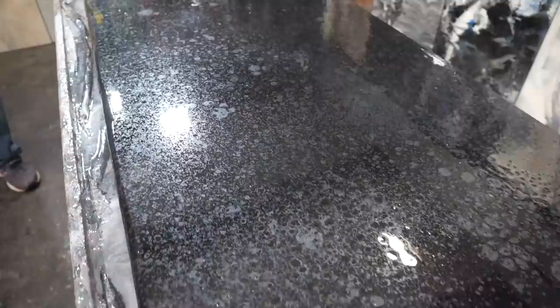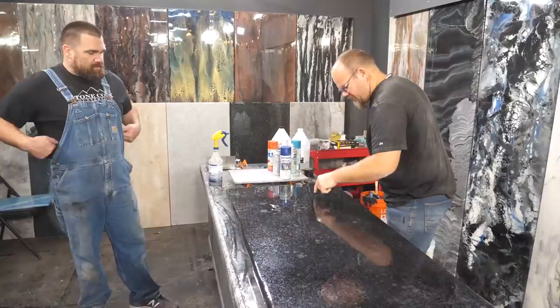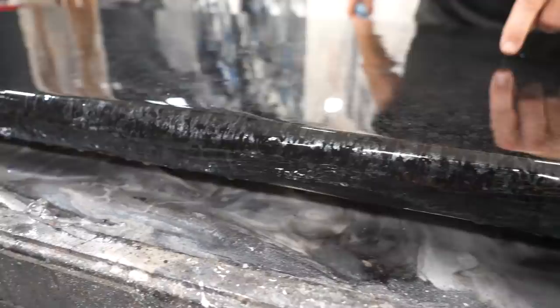You could do that with any metallic color over any other color and get different recipes — you could use a different color glitter even. I used about one and a half ounces per square foot here, and I troweled it with the popsicle stick. Look at how well it's leveling. Your edges are looking really good too — that silver's rolling over this front edge. Looking nice.